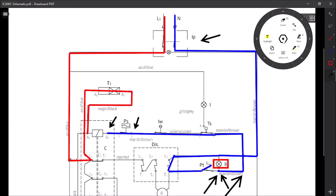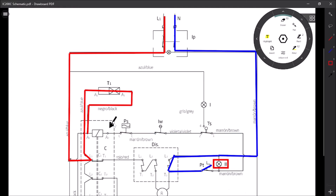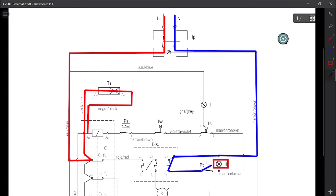So basically what happens: if this switch here - the thermal overload for the gear motor - is open, we actually start to back-feed through this coil. A1 comes through to A2 because our neutral did not come around, then we come through our safety loop, and just like that we have our hot and our neutral and our light turns on. We're back-feeding through the coil because this switch is open. So our hint is: the only way for this leg to turn on is if we have a problem with PT - the thermal overload for the gear motor.